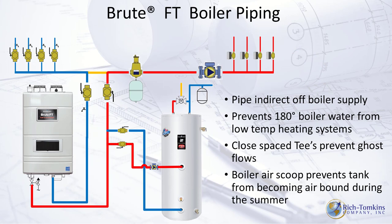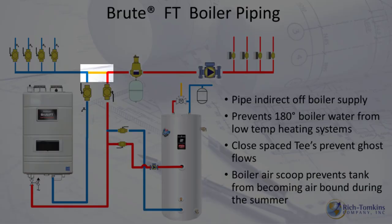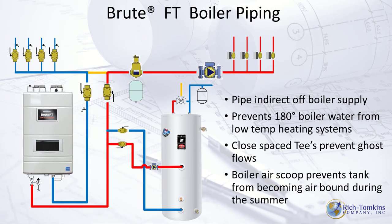Boiler piping: when replacing a non-condensing atmospheric boiler in a direct-return system — where a dedicated supply and dedicated return never touched and the boiler was the common piping — you can add a bridge between supply and return prior to the boiler. This bridge creates primary-secondary piping, so the onboard circulator circulates only through the boiler and that associated bridged piping. Everything outside the boiler loop is hydraulically separated — two different worlds.